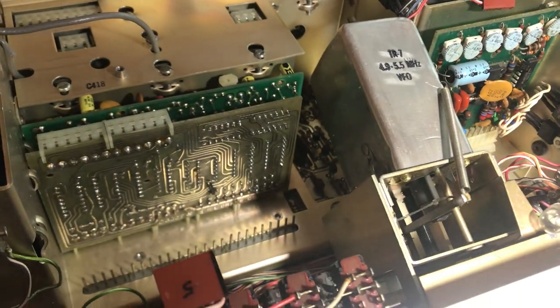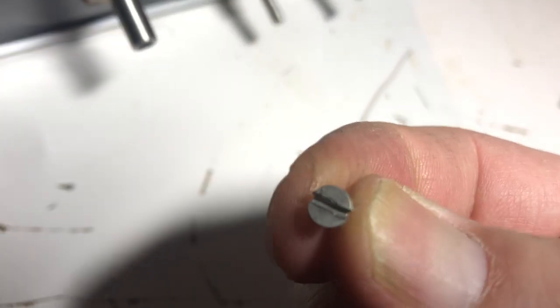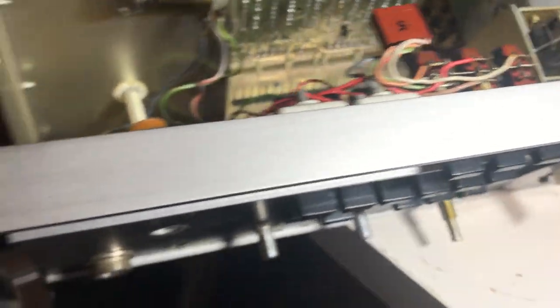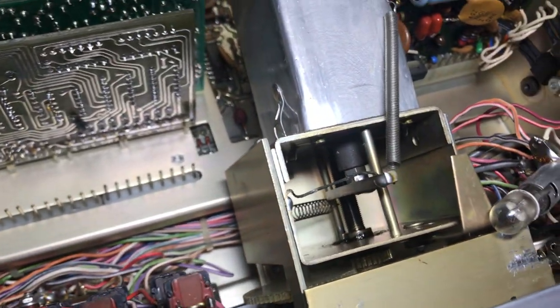The light bulb for this front little panel is not easy to get to. You've got to pull out the whole display board — and this is the display board here — which you've got to get out. And then you've got to take the sides of the case off, little protective covers on either side. Those come off the sides with Phillips screws, and then these little guys are in the side here. Those come off on either side, and once those are off, this will tilt down so you can gently try and unstick it from the bottom, and then it will tilt down. Don't tilt it down too much because it's still wired in.